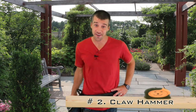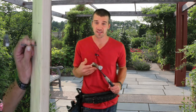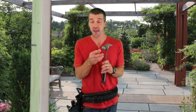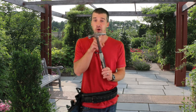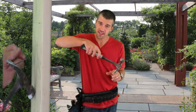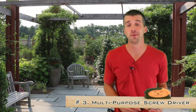After the tape measure, of course you're going to need a hammer. These come in various weights and are great for framing walls, demolition, or even hanging a picture. The heads come in different sizes too. There's a smooth head for finishing work and a waffle head designed for framing, which grips the nail instead of sliding off. The claw is also very important — I prefer a straight claw so you can easily pull out a three-inch nail.